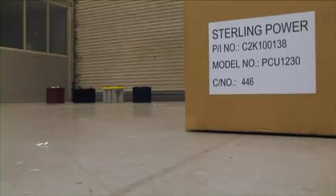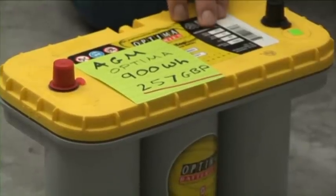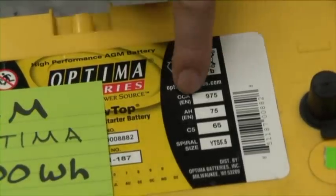The two cannot be mixed — you cannot have cold cranking and deep cycling. This isn't opinion; we're an engineering company and we do the tests here regularly, we destroy batteries on a regular basis. The proof is on the battery itself: if you look at your battery and you see CC, or cold cranking, it's a starter battery. That doesn't make it a bad thing — you just need to understand where you would use that battery and what to expect from it.